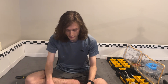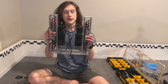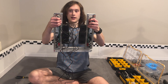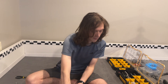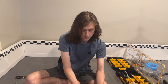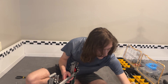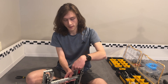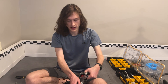And now you can see these two sections of the drive base are connected with the big mess of wires in the middle. I'm sure some of you are already seething in the comments that there is no cross brace at the front of the robot, because right now this whole drive can flex in and out. So in order to fix that, we're going to add a brace across the front. Since I used a 26-hole long at the back, we will be using an 18-hole long at the front of the robot. Because most robots are going to have an intake or something, I will be doing this at the bottom. I would highly recommend using shoulder screws if you have them, or mounting this down with some spacers in that gap to give more room for an intake. This is a generalized drive base and not specific to any one game.